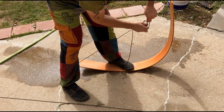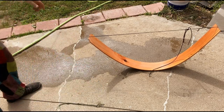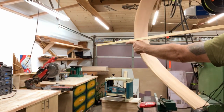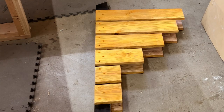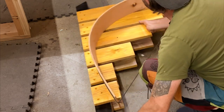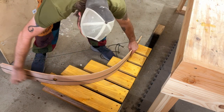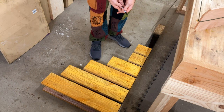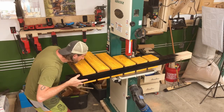It's really changing shape now. I'll let it dry naturally while I get some breakfast and come back to it. Once dry, the bend held. I'm starting from the base of the curve and going straight across. I'll take it over to the bandsaw, raise the blade up, and trace it straight across to cut the curve cleanly.